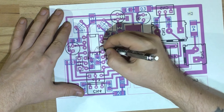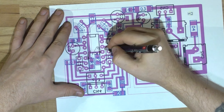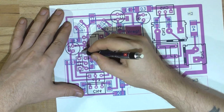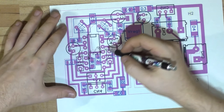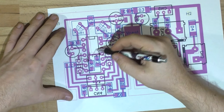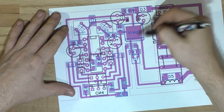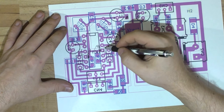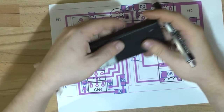And that pin also connects to ground through a 1 microfarad ceramic capacitor — same for both channels. Once you've done this modification, pin 4 can accept a button to ground as a reset button. Without the resistors and capacitors you'd be shorting the voltage regulator output to ground, so the 22k resistor and 1µF capacitor are essential. That's what I've done here — you can see I've added those capacitors and the link on the board.